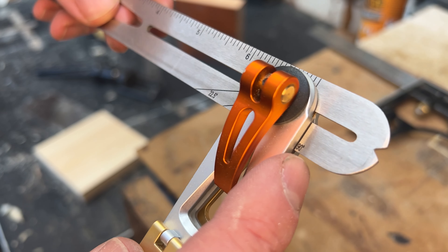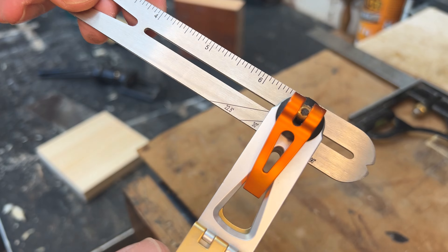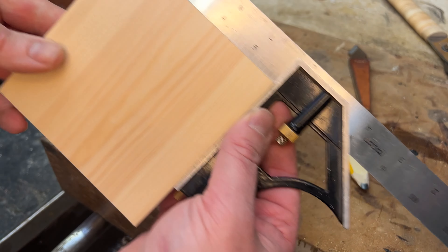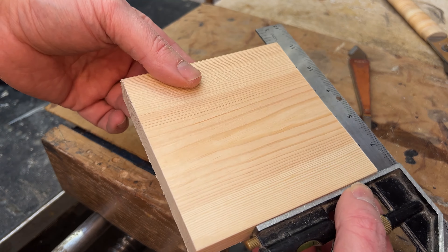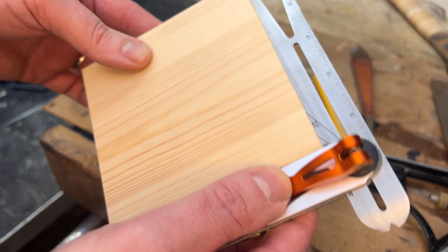Now these have 90 degree markings, 30, 22.5, and there is a 45 in the middle as well. I personally would never use those for marking out a 90 degree square — there's too much play in setting it up. It's a tiny little line and if you're a fraction out, it's not going to give you anything like a true 90. What I would use that tool for is setting an angle that's already been cut and comparing it to see what it's close to. For the sake of argument, here is the square I use every day, and once this is set to that 90 degree it does set the same thing — that's as accurate as I can get that.